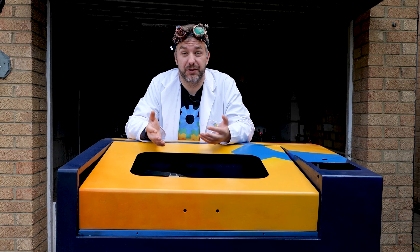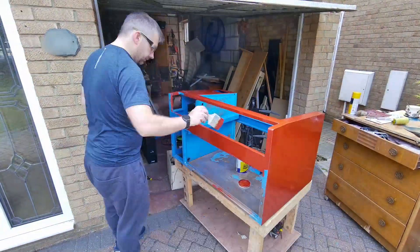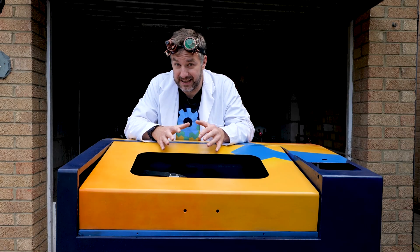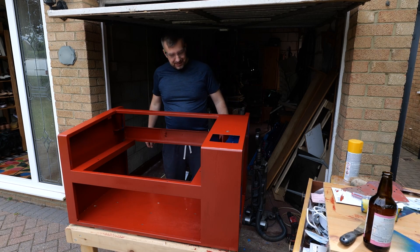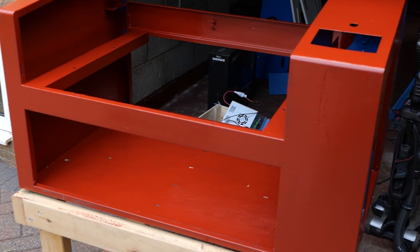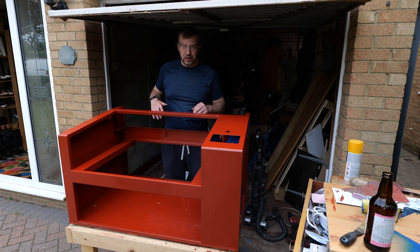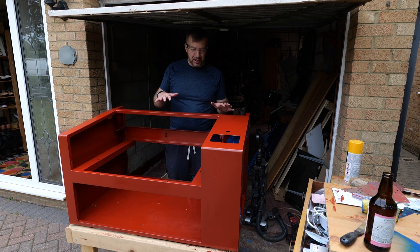My plan was to provide a semi-smooth surface, then prime it and sand it again to get rid of the marked areas where the paint was completely gone. I obviously wasn't stripping all the paint down as that would be very time-consuming. Priming is done and it's looking nice — red, actually. You can see all the imperfections and paint leftovers are very visible now. Some parts I'll paint over and some I'll simply leave with just primer. The plan is to wait for it to dry, re-sand it smooth, and then spray paint it.